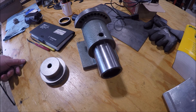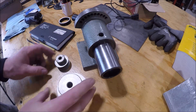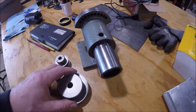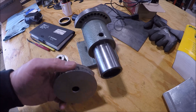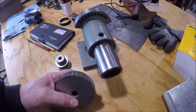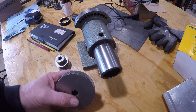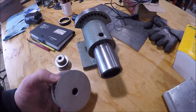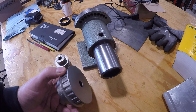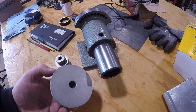It's the next day - the UPS man arrived with my two pulleys. I went with steel. My thinking is a little bit of weight out there might act like a flywheel to help give this spindle some momentum and a little torque, since this sewing machine motor doesn't have a ton. I may be shooting myself in the foot though - this may end up being too heavy. We might have to revisit this and go with an aluminum or Delrin pulley, but we'll see.